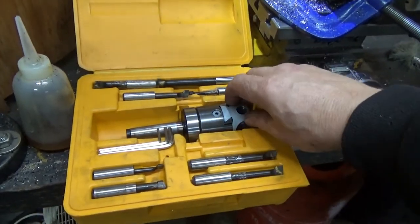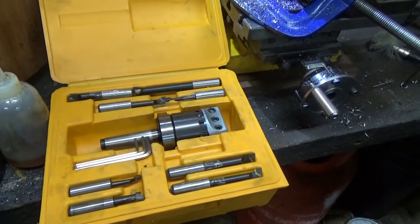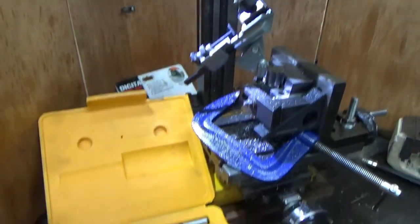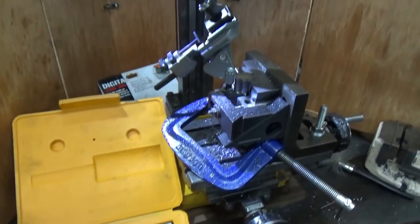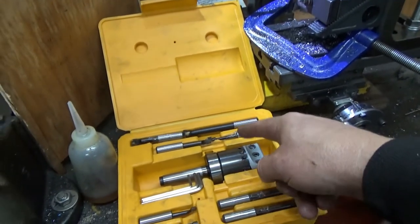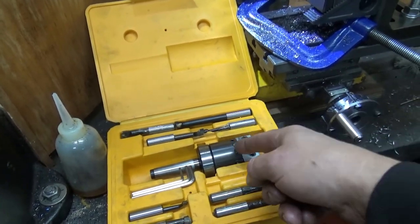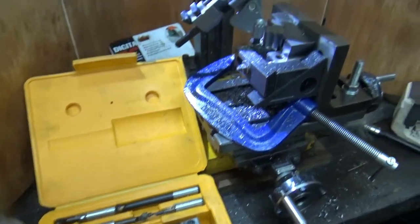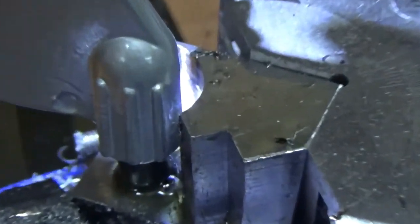It's not advertised as having an auto adjust mode, but I can guarantee you at 5000 RPM in this thing, when it's offset by around about 8mm, which it was, and the vibration starts going, it auto adjusts itself. It takes the backlash out of the lead screw inside it. So it went from a 0.5mm cut, and it looked like it was taking around about a 2mm cut, and that is why the gap there is so massive. I didn't want it to be that massive.